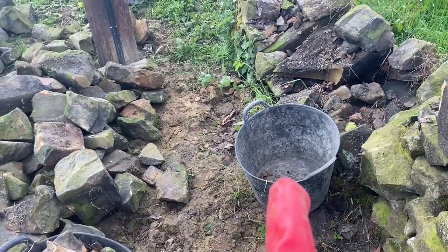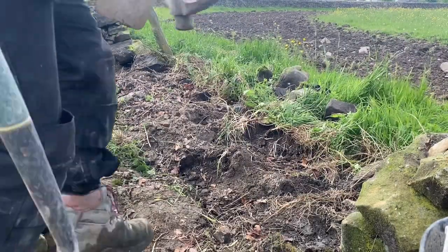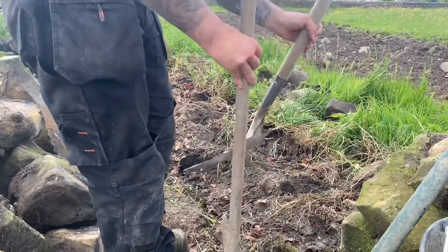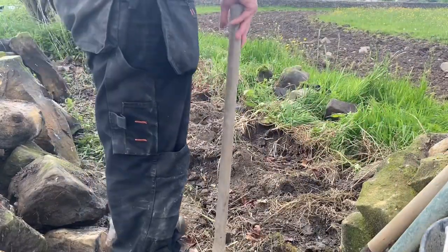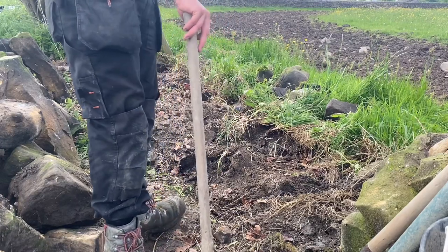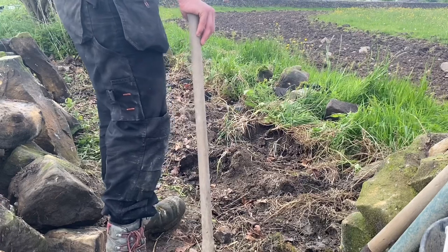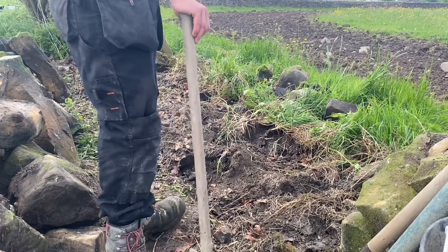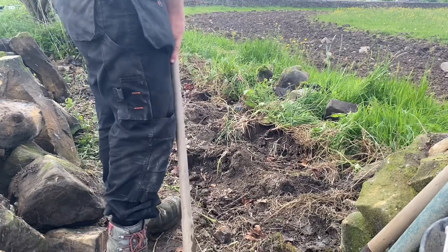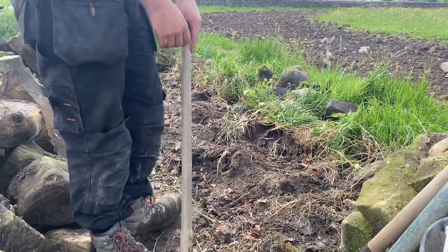This is where we're going to bring the spade, shovel, and pick into play. All we're going to do now is dig out some of this bulk here, then put a line on the wall to get our footing's width, and then dig them exact. There's no point digging everything out because you might be digging stuff you don't need to. We'll get the bulk of this rubbish off so we're down to a good ground level, then put lines on and see where we're at.